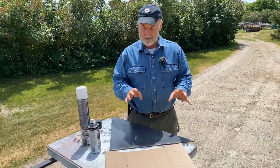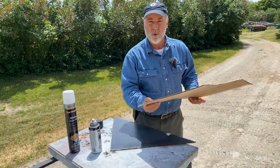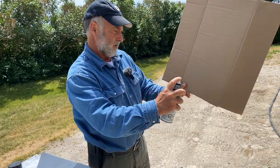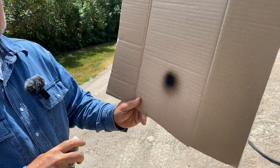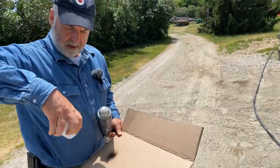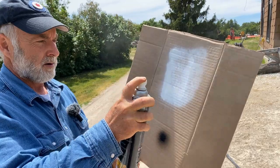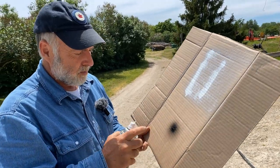The quarter-inch plate steel is all dry — it's been sanded, it's been degreased. Here's a regular spray can just to compare: holding it about six or seven inches away, that's the size spray pattern you get — pretty typical. Now at about the same distance with the Ultimate Turbo, you can see it's much more like a brush than a point application — much wider coverage.